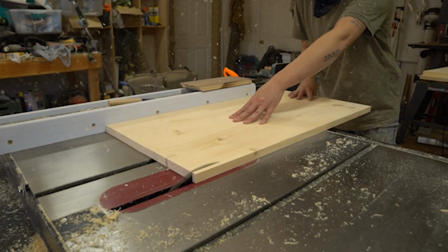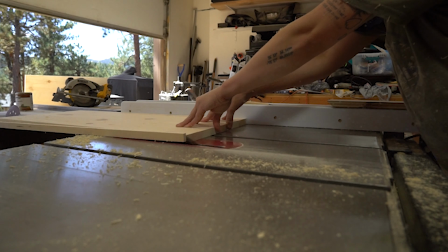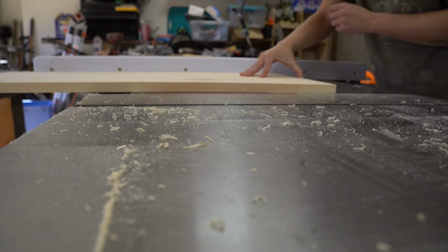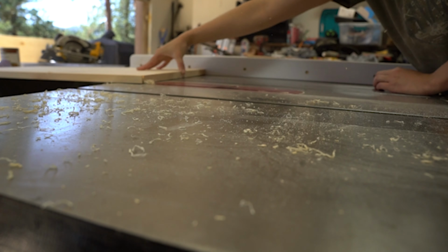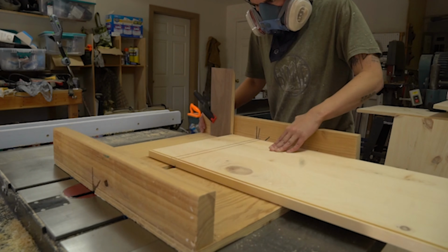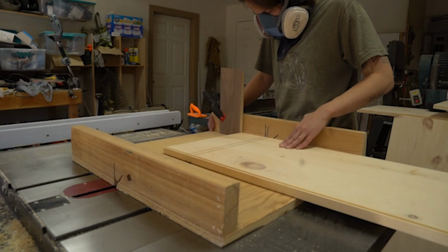and another trim to account for the addition of the face framing in the future, I added 1/4-inch rabbets on the back length of each piece that would later become a side panel of the cabinet. These would accommodate the cabinet backing. Then I cut 3/4-inch dados roughly 4 inches above the bottom of each side panel to accommodate the bottom panels.